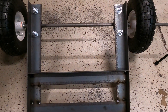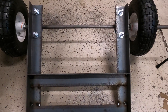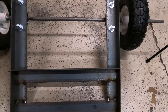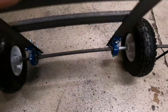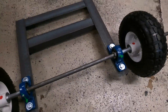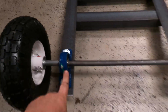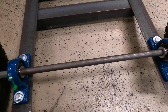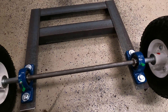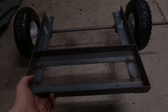We're into our first step. I have four pieces of 18-inch angle iron, one and a half by two inch. I basically cut this to the width that holds a deep cycle battery so you can just set a battery in there — it doesn't have to be strapped down. I've drilled four holes for my pillow blocks. These are super nice — they have a Zerk fitting and a jam nut. Eventually we're going to get our sprocket in the middle, but for now I'm just getting the cart together. We're going to get that swivel wheel attached next and then see about putting some power to it.